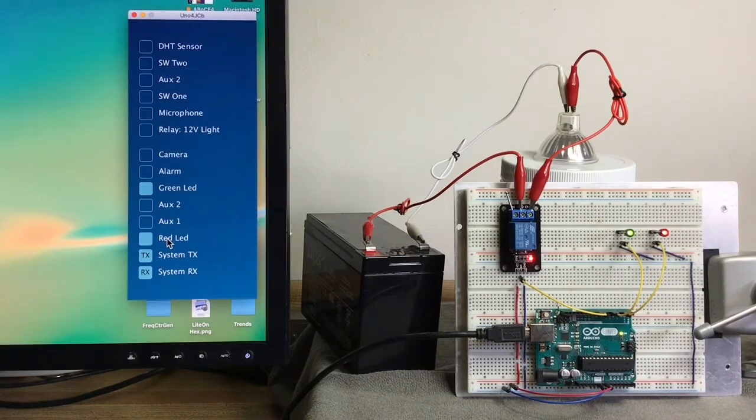This is a substantial difference in what's going on. The red and green LED and the relay turning on and off is a totally different part of the code. So there's code, fill the square, empty the square. That's one section of the code. Another section of the code, a completely different section of the code, actually turns that green LED on and off. And that's the key. They have separated the functionality from your screen image.